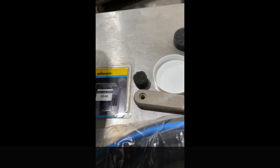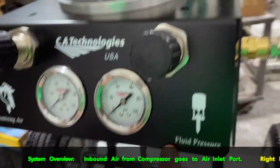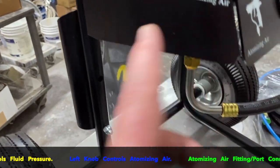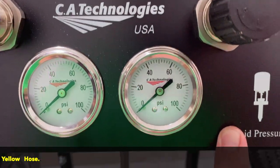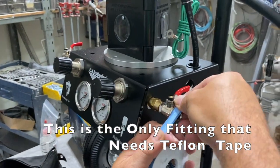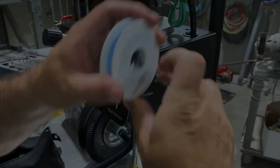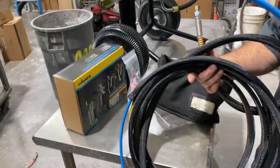Along with the 13-40 Wagner Industrial double-sided tip. As you can see, we have the air inlet, fluid pressure, atomizing air, the fluid outlet, and then we have our two sensors — this is for atomizing air and this is for the fluid pressure. We'll review further in detail what our recommended settings are here shortly. The first thing we're going to do is on the air inlet — we're going to go ahead and tape that up real nice so we can get a nice seal.